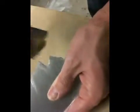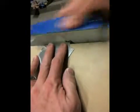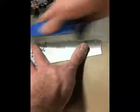And then after that, I've got a sanding brush here. I like to use this in the corners here. It's like 220 or 320 grit, just to get that final smoothness on all my edges. Sometimes I go right to the sanding belt, or for little pieces like this, I just use a little block sander because it doesn't take long to get the piece all finished up.